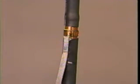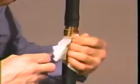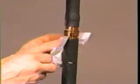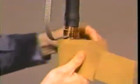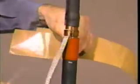For the copper tape or LC shield cable, lift the ground braid away from the cable jacket. Using an approved solvent, clean the jacket for 2.5 inches below the jacket cutback point. Remove the backing from the red sealant tape found in your installation kit. Using light tension, wrap 2 layers of red sealant onto the jacket under the braid.